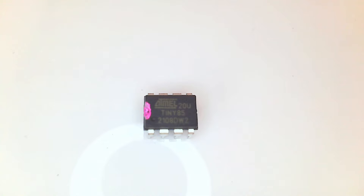For our little project the specifications were clear: we needed one or two ADCs, a pin that can do some bleeping, and that's it. The ATtiny85 was our CPU of choice. There's a core available for the Arduino IDE so you don't have to leave your comfort zone — just program it in C++. You can use Atmel Studio if you want, but if you're used to the Arduino IDE, this is right up your alley.